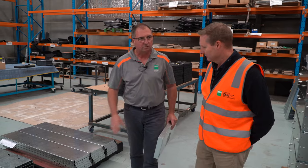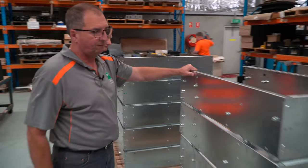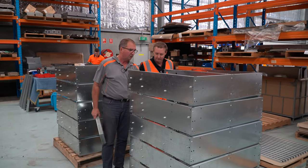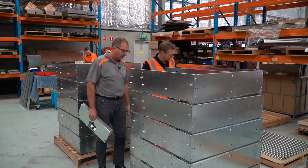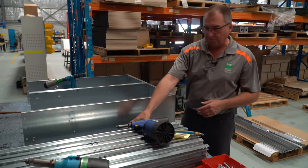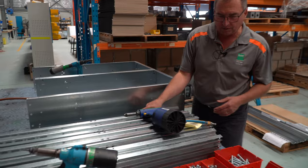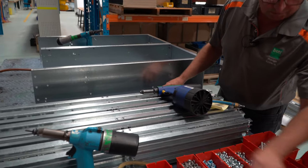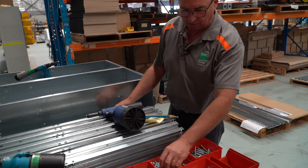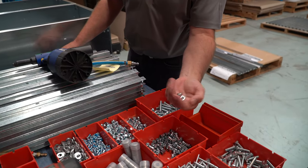The side units, the uprights — so this is a drawer carcass, the framework for the drawer. The bearings are installed, mount rail on the base ready to go. So this is obviously being bent up, set up, ready to go. Mount rail in the base, the washers, the bearings, all the riveting nuts and bolts to fit them. Captive nuts ready to take the top panels.